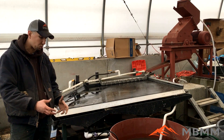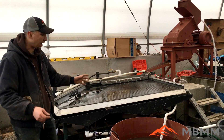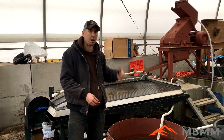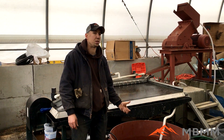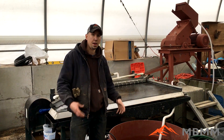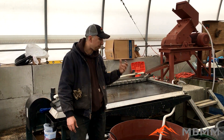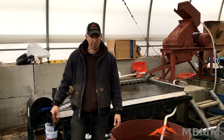This sample has so much wire and rubber and only a little bit of PCB material. I'm going to take the tailing sample right out of the hydrocyclone, because there's so much rubber it'll just pump around the system for a long time to get ground up. The system is really designed to pump only fiberglass and the circuit boards themselves. So we'll try this — we'll run the sample, gather the tailings and the one and the two, and we'll see what we get.